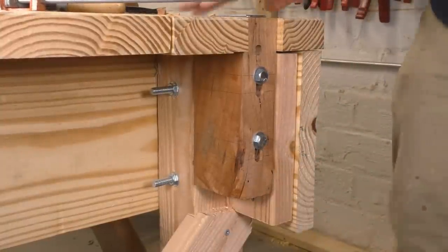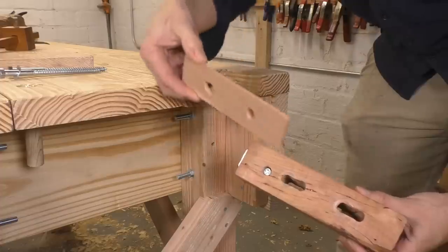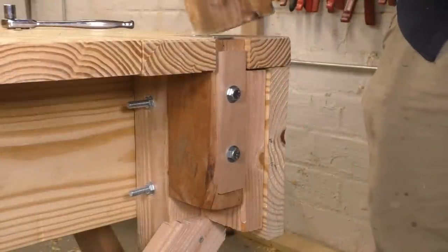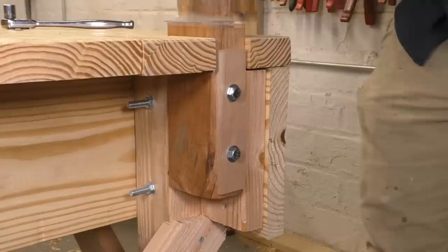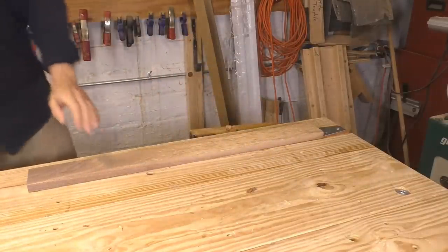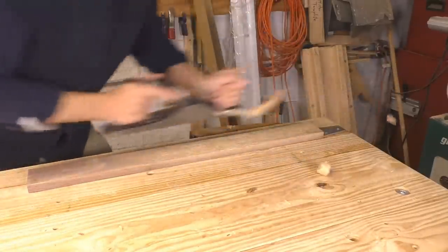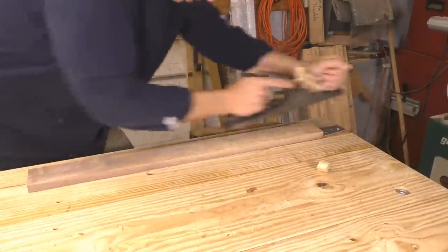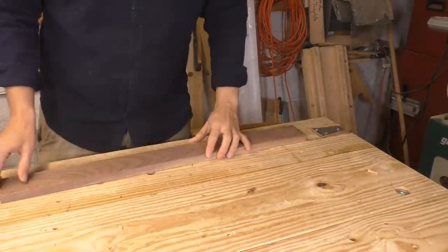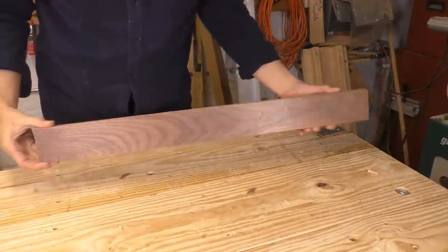This mounting method works but I was hoping the lag bolts would slide in those slots — instead they're just bending and I don't have much range of motion. So I made a little hardwood spacer to add between the washers and the post. That spacer keeps the bolts from bending and allows them to slide more easily. Now I have the full range of motion on my stop and I'm not stressing my hardware every time I adjust it. You might think the planing stop will have a steep learning curve, but right now you're watching footage of me using a stop for the second time in my life and it's a piece of cake. You can give your stock a little mallet tap to help the teeth bite down — it's a very efficient method of stock prep. If you need to flip or rotate the board it's easy, and if you're doing a stack of boards this method will be especially quick.